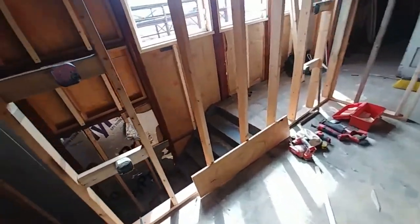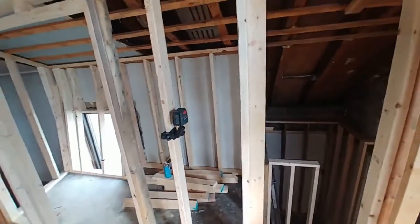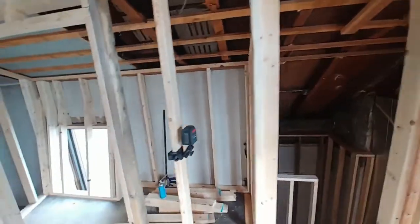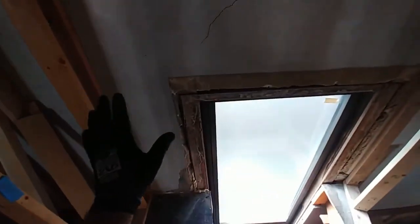We just want to keep air from migrating around in here. Every bit of breeziness within the structure ultimately ends up being energy transfer, delta T or whatever. It'll either bring warmth into a cool area you're trying to keep cool or vice versa. So we want to seal up the draftiness, and we'll use all kinds of expanding foams. And I'm going to copy my work over here where Brad got started already. I think it's overcut, but that's okay. It'll let me see what it is I'm trying to do. But then obviously, again, pumping this full of window and door foam all the way around, framing this out completely.